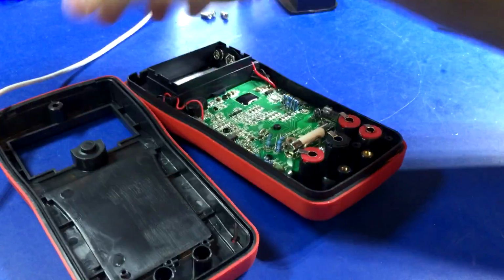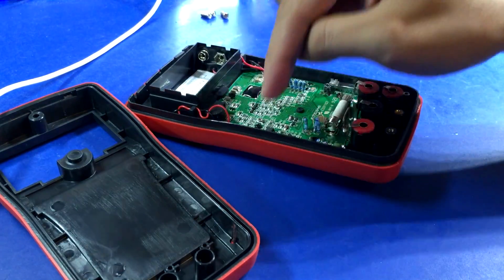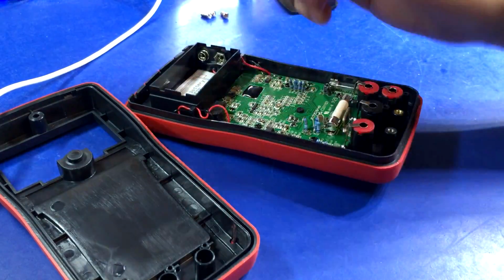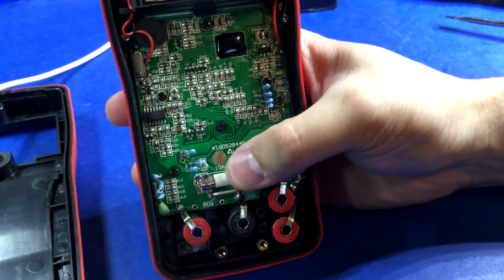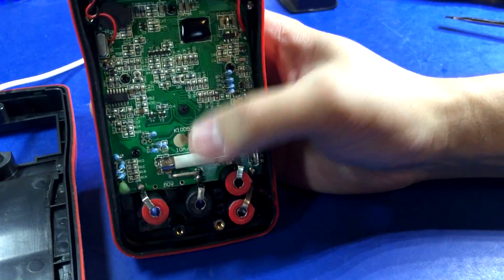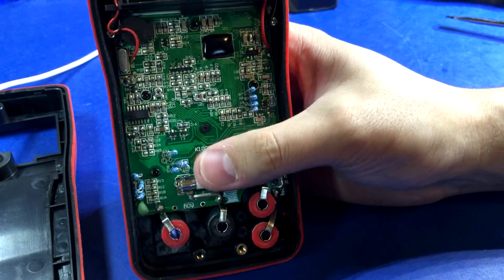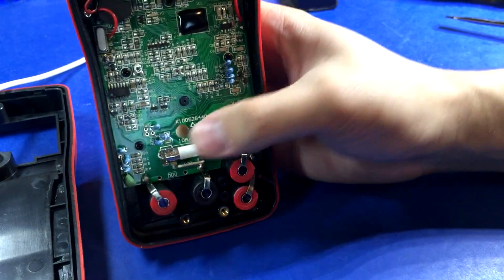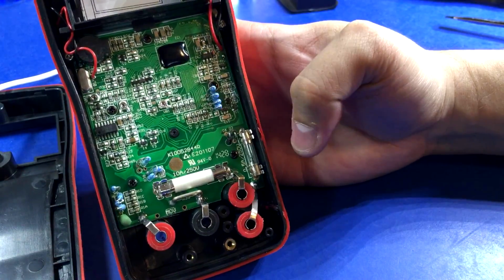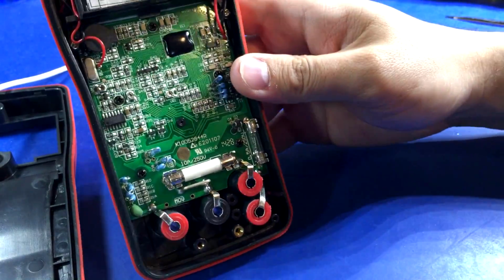And we're in! So it's got a little bit of a ridge, so it's got the 2 layers, and then this lip goes inside for blast protection, so it's not too bad. No shielding, but it's cheap Chinese Tekpower, so... The fuse at least is a ceramic type, or well, we'll assume it is. It could just be a glass one with paper around it. That'd be pretty shitty. And then the little dinky, weak glass fuse over here. That's not very good.